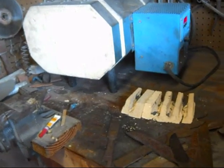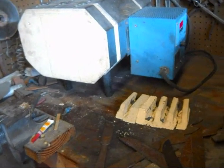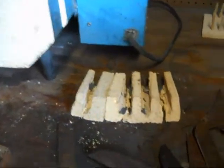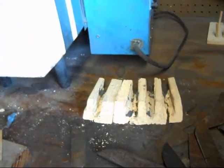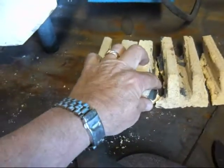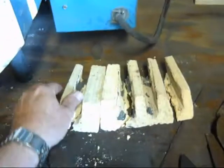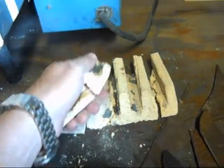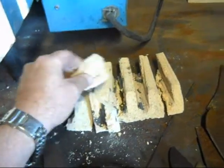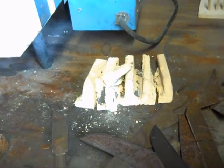I'll show you a better picture of the fixture I made for inside the oven. But I just wanted to give you an update: if anybody's using the non-scaling compound or starts to use it because of my recommendation, make sure you protect your oven and the fire bricks. As you can see, it kind of drips on it. I don't know if that's what caused this to break out, because this stuff's pretty soft — you can break it with your hand like that. The brick's soft to begin with, so it probably doesn't take much.